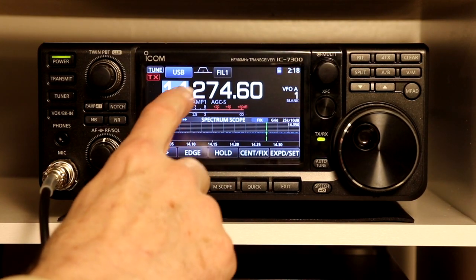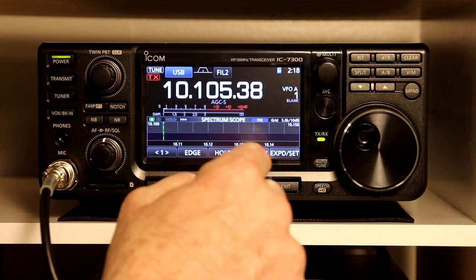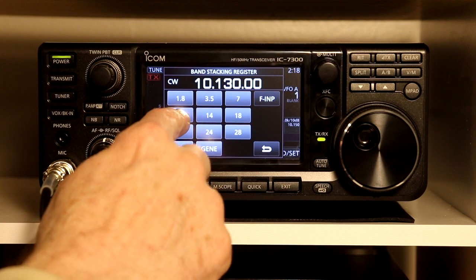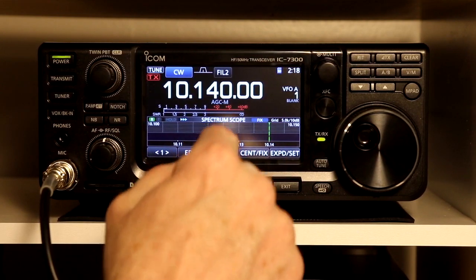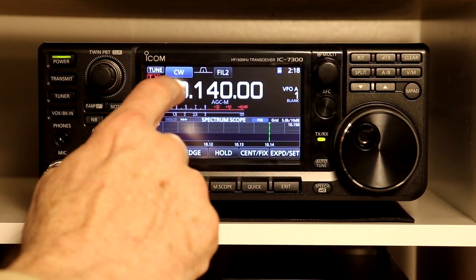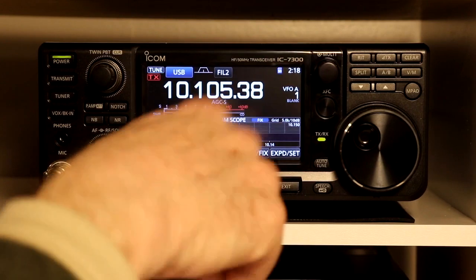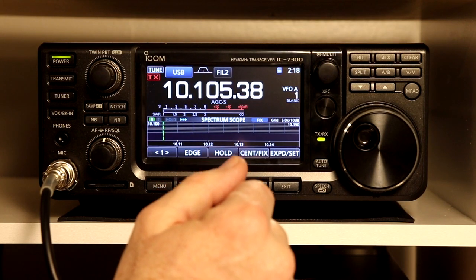In the example they go to 15 meters but I am going to go to 10 MHz because it is a little bit smaller band. One thing I wanted to mention that I didn't cover last time with the band stacking registers: you can repeatedly hit the same band and it remembers frequencies up to three different registers for that band. However, there is no indication on the screen of which register you are on — not on the band stacking register screen and not on the main screen. So you really don't know which one you are in other than looking at whatever frequency comes up.